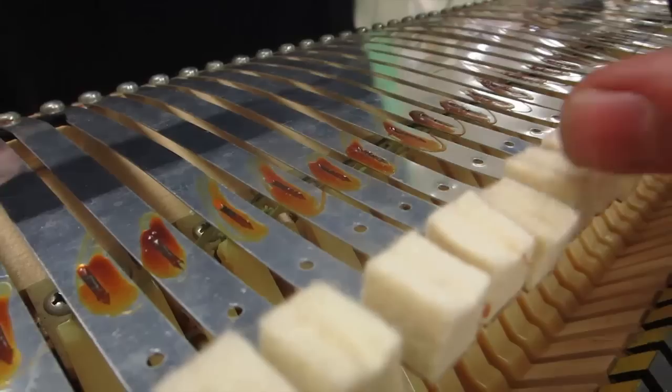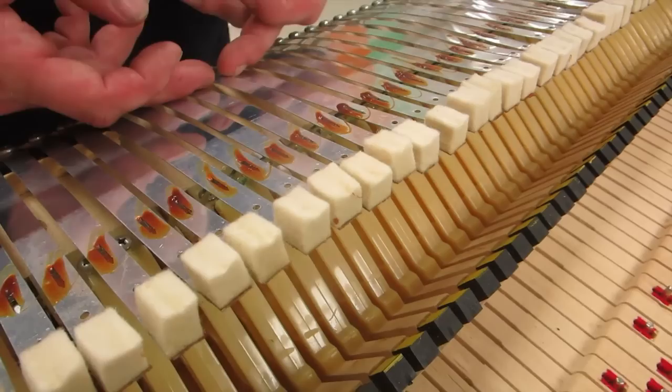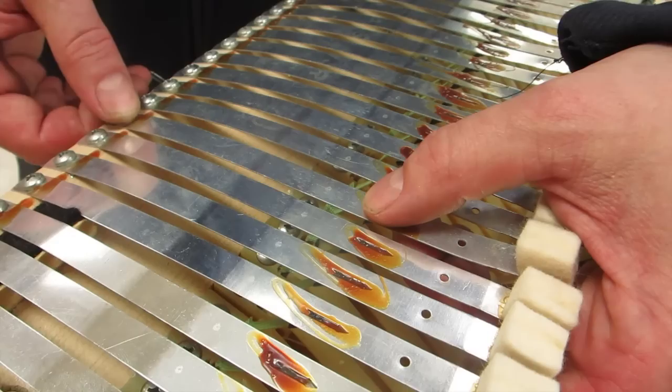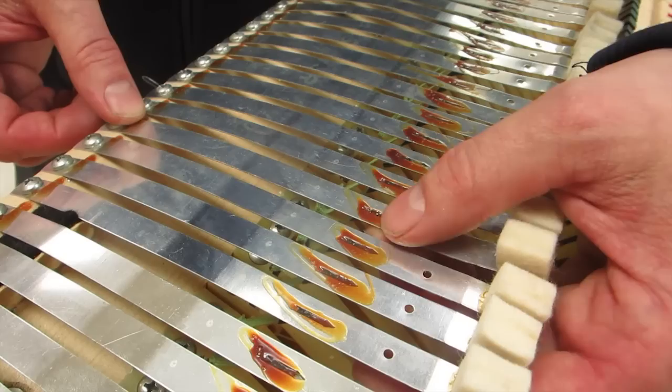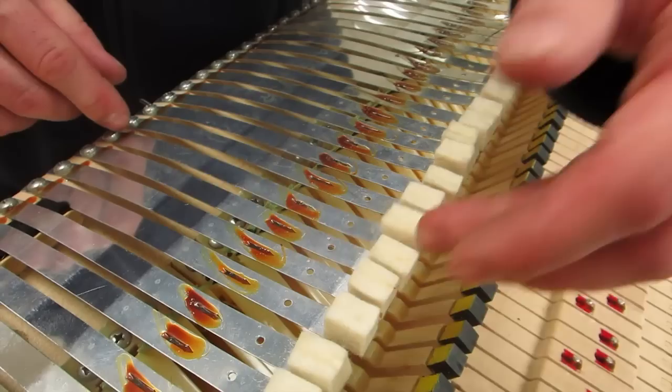By doing that, we do have an increase in resistance. It has brought it back a little bit. If it still seems like it's a little on the weak side, you can remove the screw and do what we call the reverse bend, which we just take from this surface to here and bend it around a quart size paint can. Reverse, so as if we were to take the bridle strap off and overextend it back towards us, or up around that quart size paint can, and then reinstall, and you'll get more resistance. And that can possibly save your dampers.